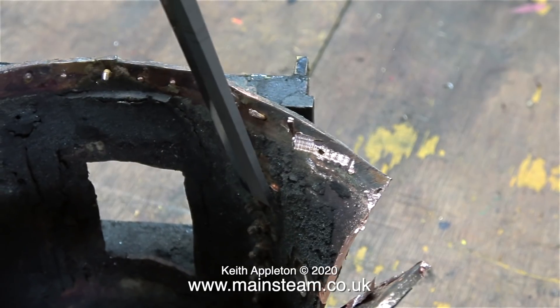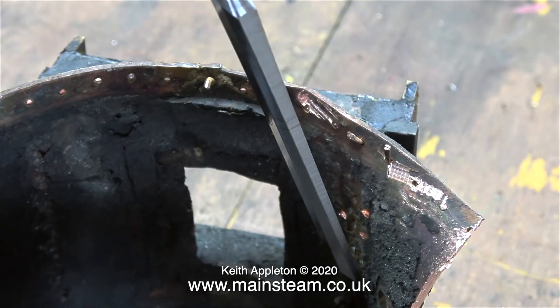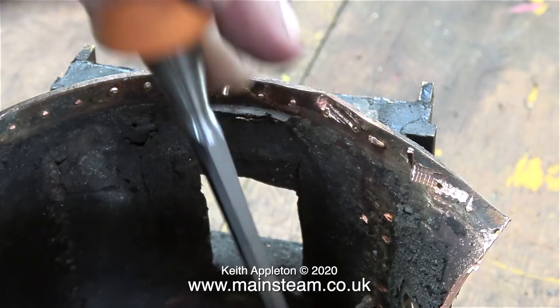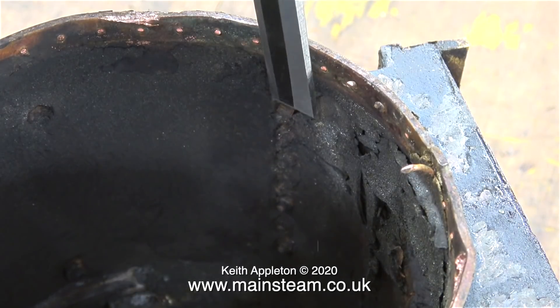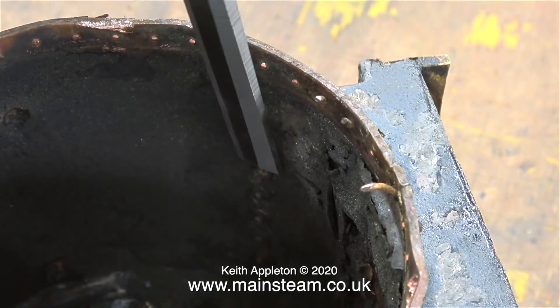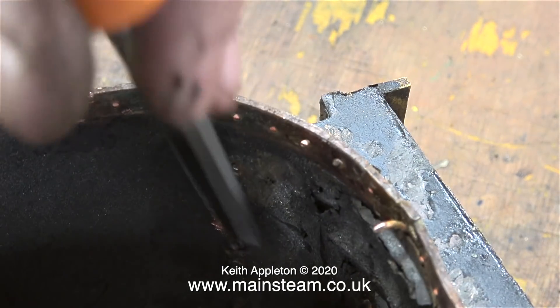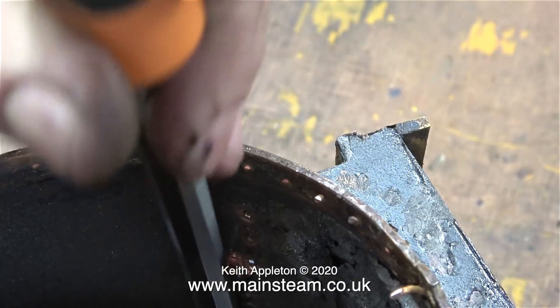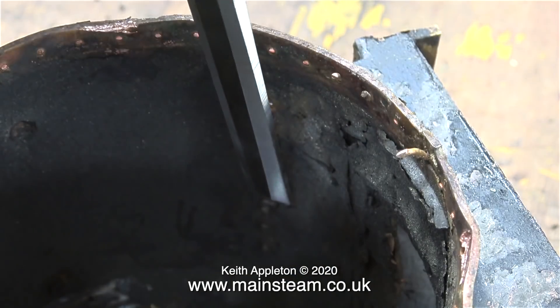This is how I remove the saddle. Never mind undoing all these small nuts and bolts — just chisel them off. For this job I'm using a wood chisel. And even though it was sharp to start with, by the time I've chiseled all these small bolts off it's going to be blunt, but to simply resharpen it I use my belt sander — it's very quick. As you can see, it makes short work of the bolts, and in no time at all every one of them is in a pile in the middle of the smoke box on the bench.